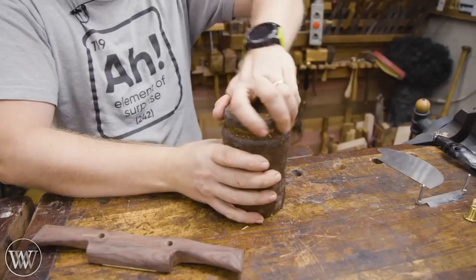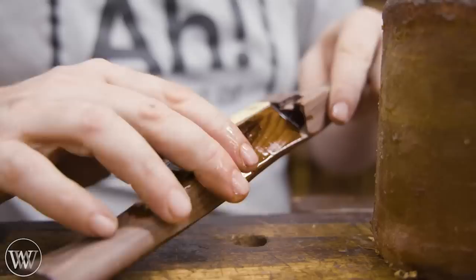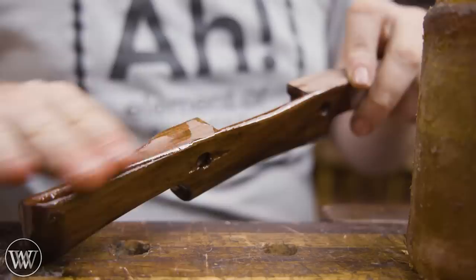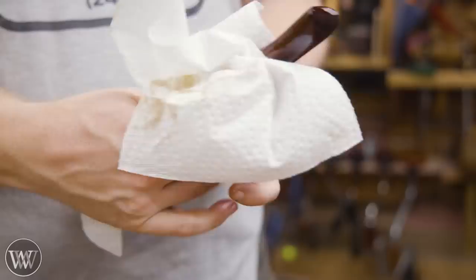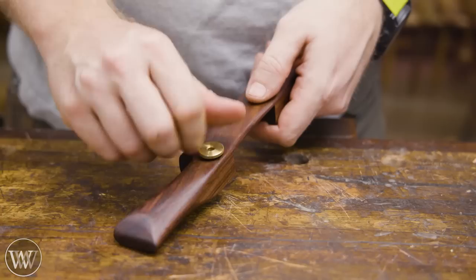This one just came out really well. I can take really nice heavy shavings and get down to shape, and then slide it over and take a nice thin shaving to clean it up. It surprised me how smooth it came right off of the tool. And of course, this is Wood by Wright, so homemade boiled linseed oil. Especially with this rosewood, the color is incredible — the brass and the rosewood together is an amazing look. I put a generous coat on, let it soak up as much as it wants, wipe off the excess, then apply paste wax and polish it down. Let the paste wax sit and cure for a while and then polish off the excess, and you get a really nice sheen surface.